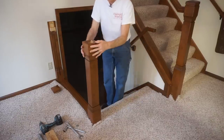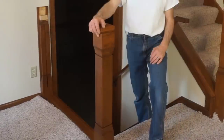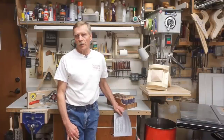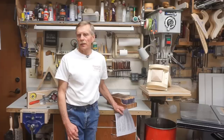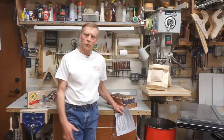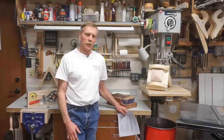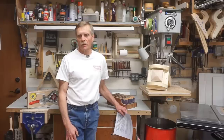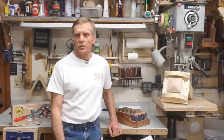I just drop the top section and dome cap on the post to complete the installation — I just love it when a plan comes together. With the post this rigid, I'll sleep soundly not worrying about glass panels breaking from wobbly newels. I'm also doing a written article about the same installation method for Pro Remodeler magazine, which will include description and extra information about how I set the other two newel posts — the one at the bottom of the stairs and the one at the top on the landing — since those installations were a little less straightforward, although the principle is the same. When that article gets published, I'll include a link in the description below for anyone interested in alternate applications for this installation method.